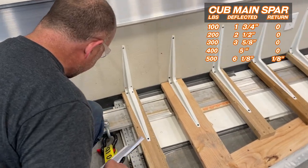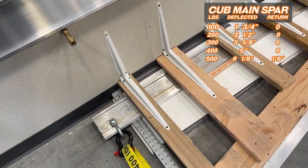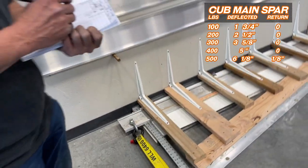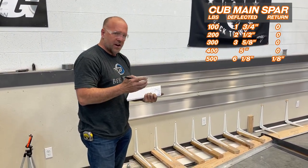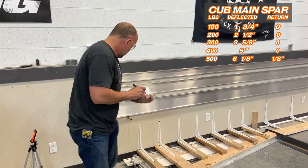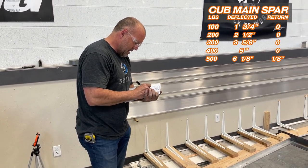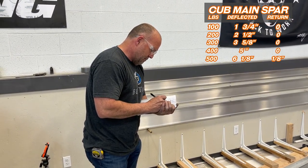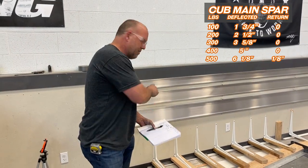All right, that's definitive. Now we're a 16th, we're 8 9/16. So I'm gonna say that the last one did move a 16th, because this was definitive, it moved another 16th. So I'm gonna put its new point at 8. Return deflection, 8.67. All that. I'm gonna put the shims back in.